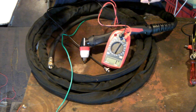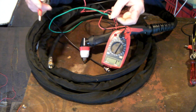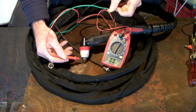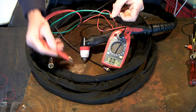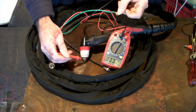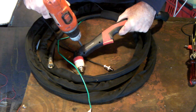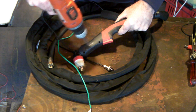If I put one lead on the green wire and touch the other lead on the tip of the cutting nozzle, we get a complete circuit - a dead short. That tells us this green wire is connected to the cutter tip, not to the electrode. I'll pull the torch apart and show you where that wire actually goes - it goes to the tip, not the electrode.